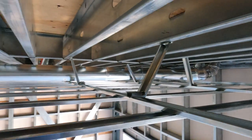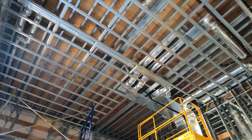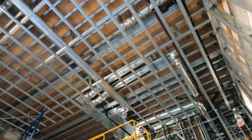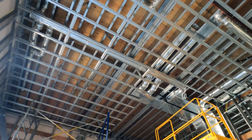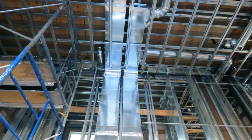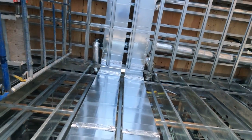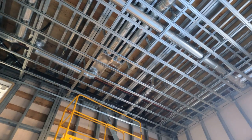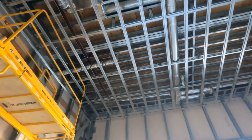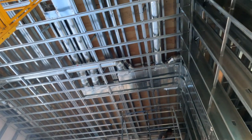The trick to this ceiling is checking all the ducts, making sure you've got the lowest point, and going as tight as you can. When it's time to join — put the rest in — you just measure to the end, overlap the hat track, screw it in, and all the bracing picks it all up. It's so strong. Right where the duct is, we stopped the hat track just before it and put a piece of angle between — like a header — and that's how we finish that in. We went as tight as we could to all the metal; it'll all be hidden in the end. This is Chris Conkle — I hope you enjoyed the video, hope you're subscribed to the channel because there's lots more coming. Stay tuned and watch the next video.